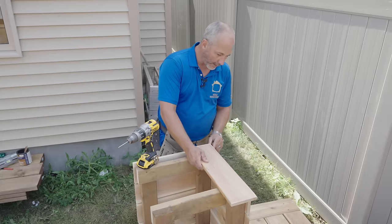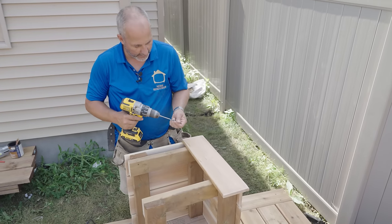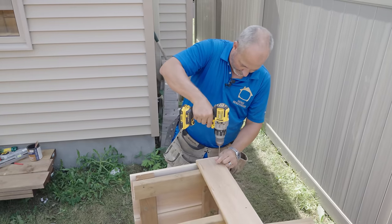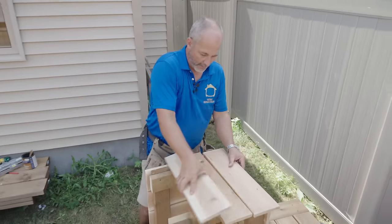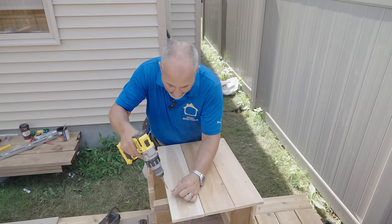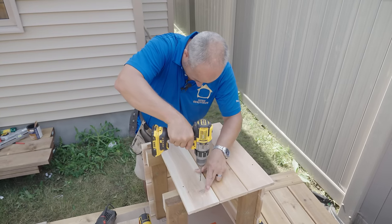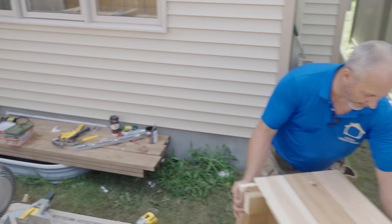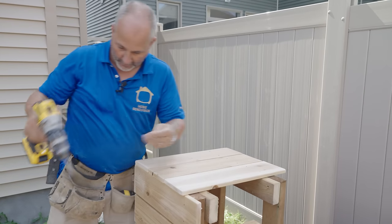So we're going to line up along this edge first to my point and put a screw on the back. Finish screwing this line first, and then I'll make the adjustment for square. Let me just turn this way. So I'm flush here. In order to get square here, it's just a matter of opening this bad boy up a little bit.